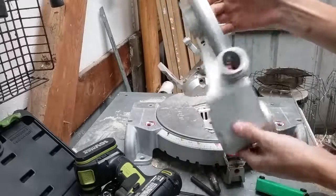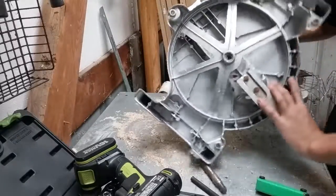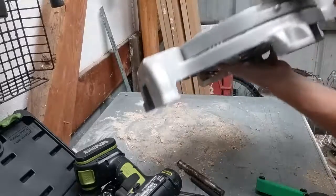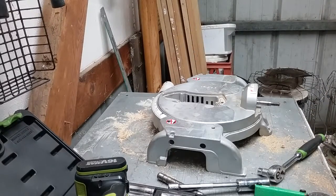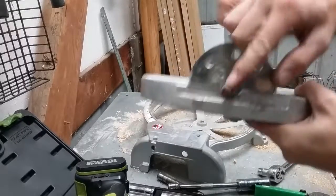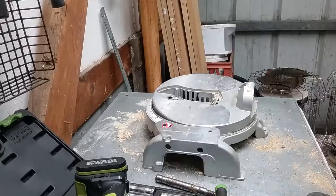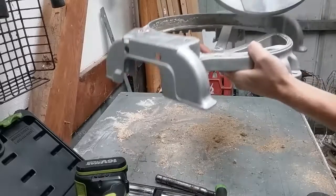This piece is solid aluminum. I'll take off this piece that's steel, then aluminum - take off this bolt and I'll be pretty much done with the base of it. To take this bolt off you're going to have to drill out those two rivets and take out that one set screw. Got both those parts apart - those are all cast aluminum.